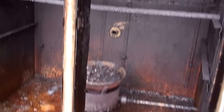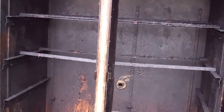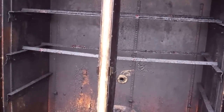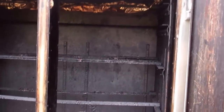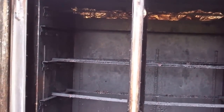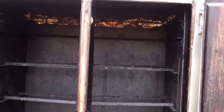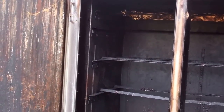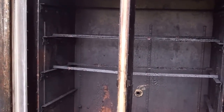If you want to build your own smoker, don't get an old refrigerator with plastic insides. If you're just cold smoking cheese or something that's fine, but if you start creating any heat you need one with all-metal interior. You're better off going to a restaurant supply place — maybe one where the compressor went out. Start calling around restaurant supply houses that sell secondhand. Also try implement places that work on commercial refrigeration — a repair company might have one sitting out back where the compressor went out and they moved it out.